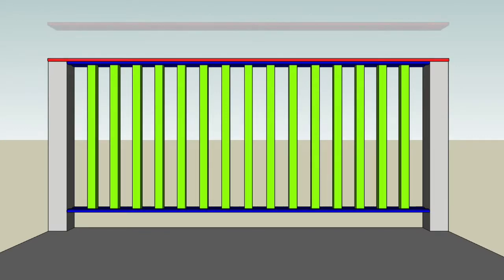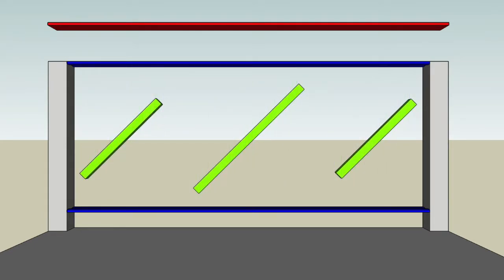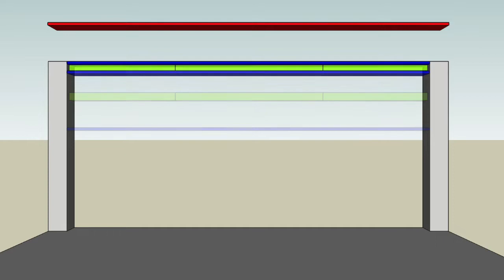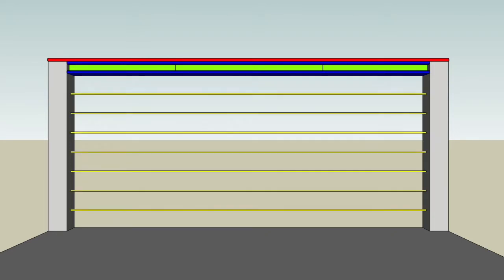Using the existing wood, my plan is to make a stronger handrail by laminating the upper and lower rails around balusters that will be spliced together. The original balusters will be replaced with stainless steel cables to achieve a more modern appearance. I'll also install LED lights in the post to provide accent lighting.